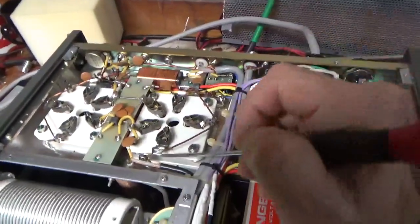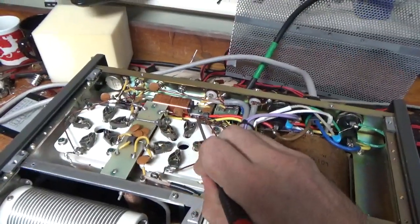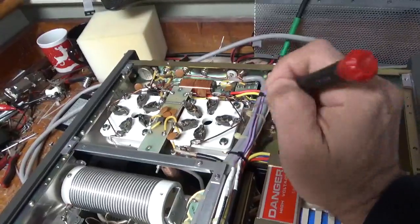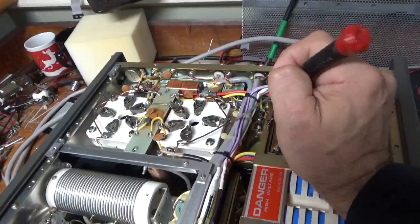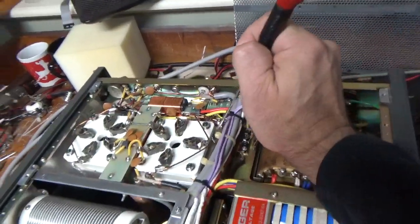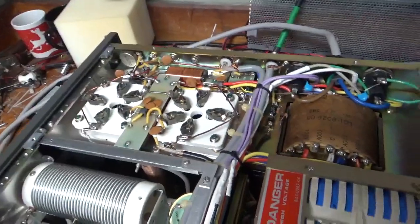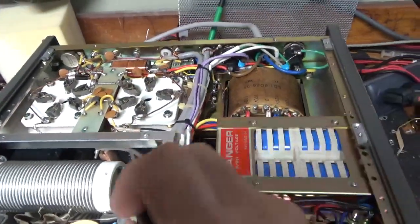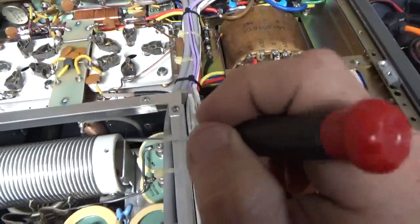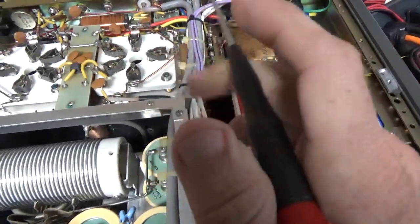The grids were not grounded. The solder joint is barely soldered over here. You don't want to use wire — I see a lot of people using wire where you're supposed to use strap. I go from each grid connection directly to these posts here, one here, one here, one here. I'll pull all that out, redo it, and add a strap over here so there's a better connection between the plate tuner variable cap and the tube grid. That'll increase the stability.